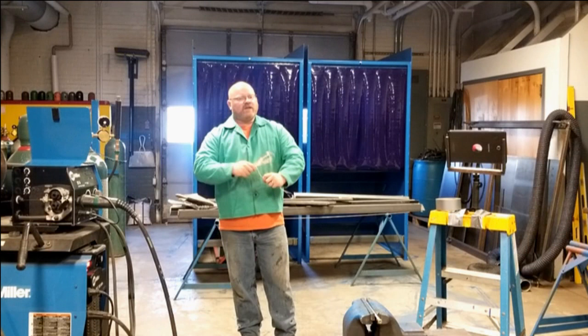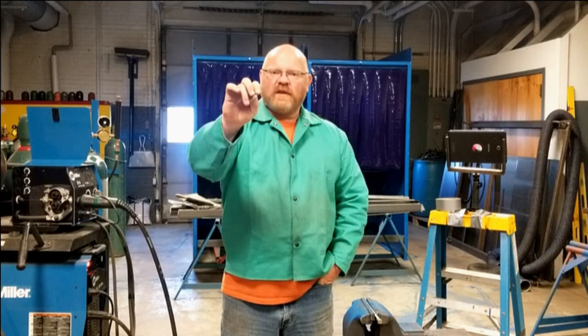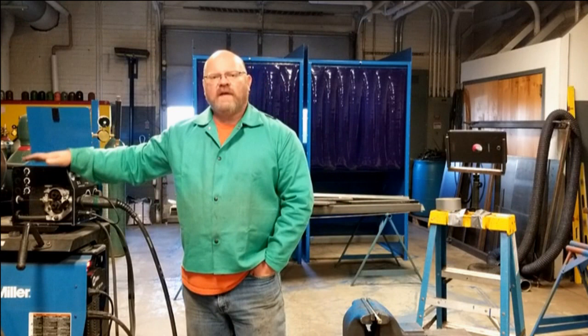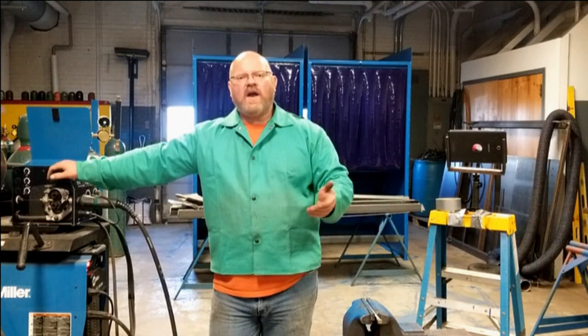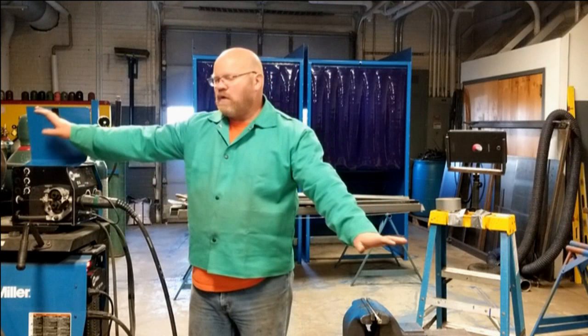The drive rolls will push that wire — they've got a lot more grip than my fingertips. The problem is when the gun gets into a loop, the drive rolls start to grind on the wire and actually shear off parts of it as it slips. It's like getting your truck stuck in the mud: the wheels are turning faster than the car is moving. The drive rolls turn faster than the wire moves, which feels like someone turned your wire feed back. And all those little metal filings cling to the wire because of the magnetic field generated by the electric arc, sucking metal particles up through your liner.